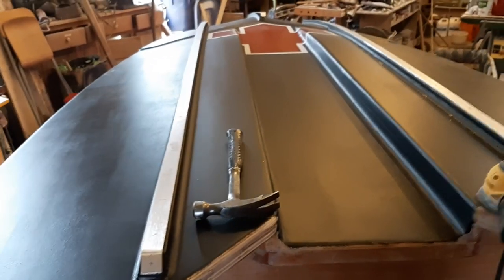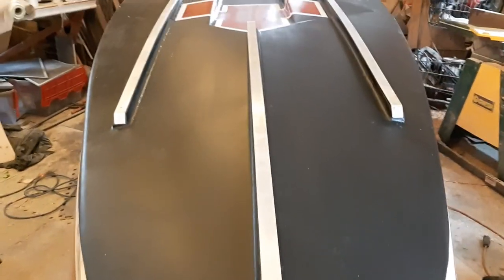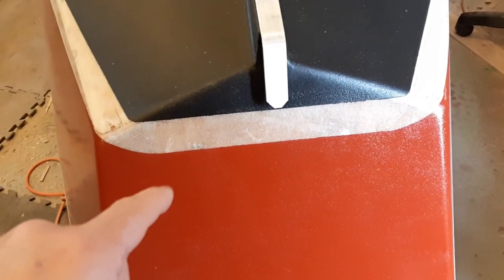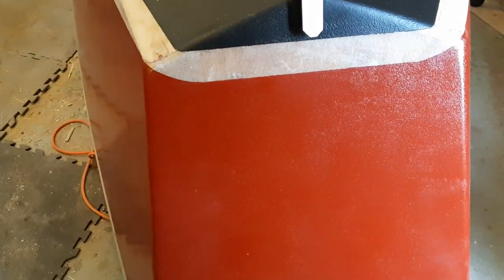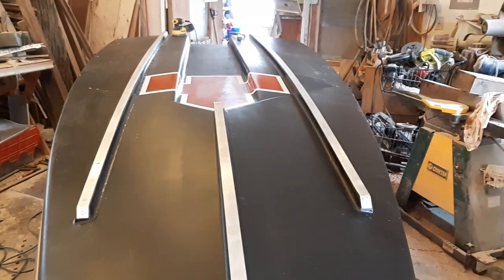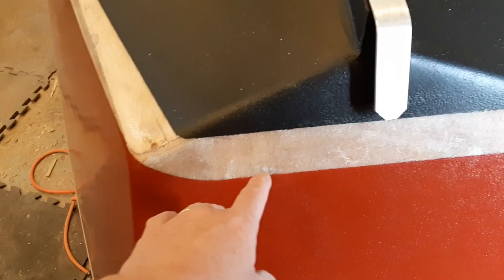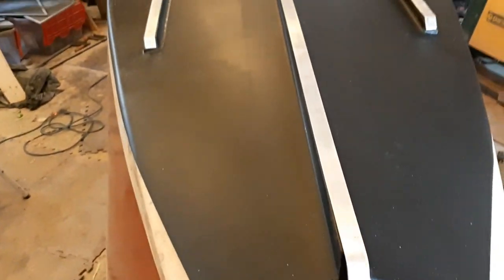I'm going to miss seeing the bottom of the boat because I'm loving the form. The V entry is nice. You know, can you imagine when I get the bow cut? So we have a landing craft drop door there. And there'll be like a policeman's push bar on this so that we can basically ram shore, and hopefully I will have enough aluminum to clad the outer edges of that push bar as well. So I think that will add to the look and tie in. I haven't yet painted the pinstriping. I'm debating to go with a fine black on the outer edge and thin, or all white. Well, it's not white. It's actually a gray, but it comes out looking white up against the colors.